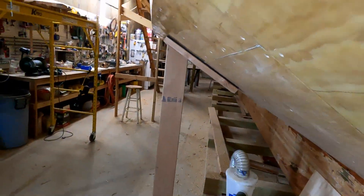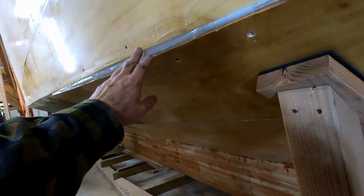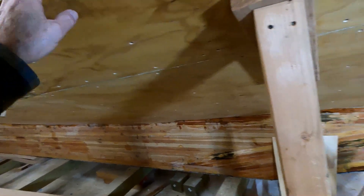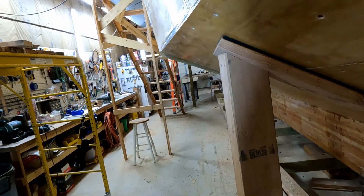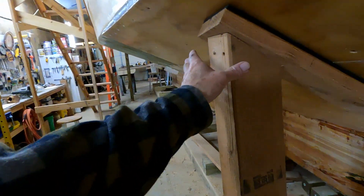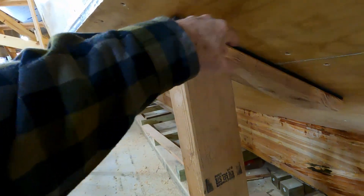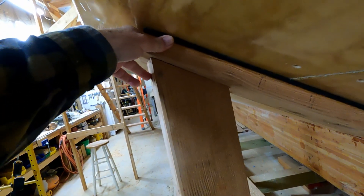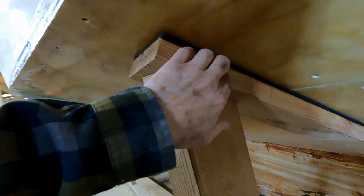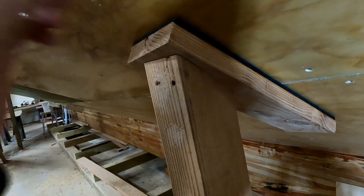Moving back, I got another piece in here. I had to move my supports around again. To keep working while protecting the near-finished surface - we don't want to be scratching it up or putting extra holes in it - I made a block and used contact cement to glue some quarter-inch neoprene on it, the same grippy material I used on the fuel tanks.